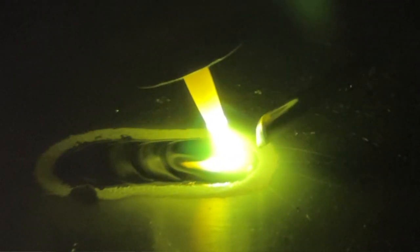Now, another really common mistake that you see a lot of the time is this. People get set up nice and comfortable at the beginning of the weld, nice and tight, good standoff distance on the beginning. But as it goes on, take a look at it. We're getting further and further away. This is basically because of a hand posture that is uncomfortable.